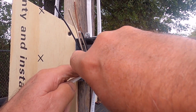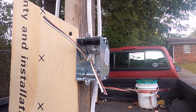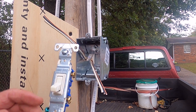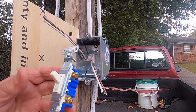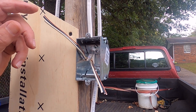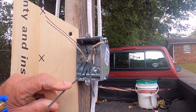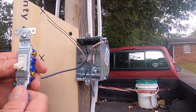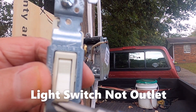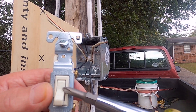That may not be exactly six inches, but this is just more or less for demonstration so I can show you the wiring techniques of it. This is your pretty much standard cheap 15 amp — that's what most people would buy, probably get it for a couple dollars. All you want to do when you hook up a light switch is hook up your two power wires. I want my power supply coming into the bottom of my outlet. You always want to look on your outlet — up here at the top it says 'off,' flip it and it says 'on.' It just makes it easier knowing your power comes in the bottom.